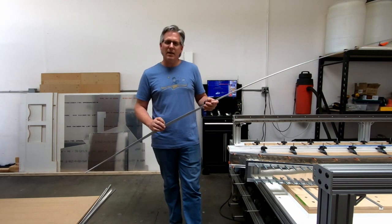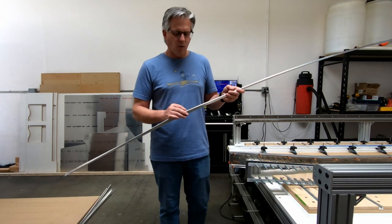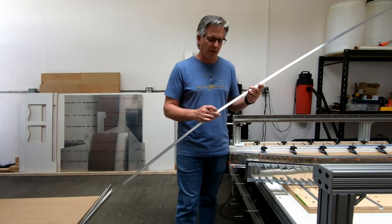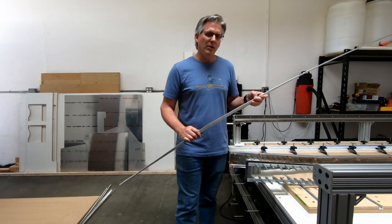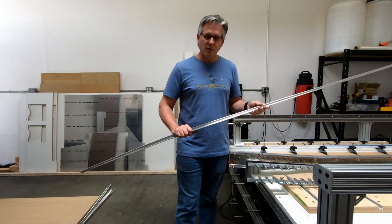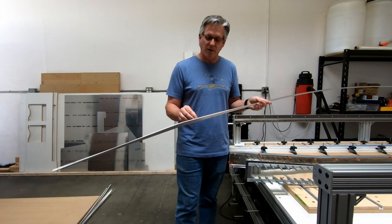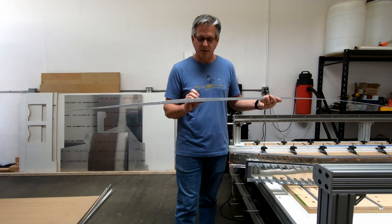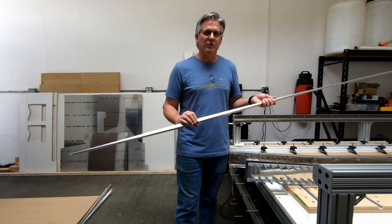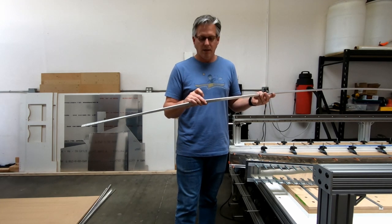So the fix is either mill that radius down — which most people don't have the equipment for — or move the rivet holes to make a little clearance. I milled my radius down to 0.125 and left the rivets in the spot specified in the plans, which is 7.5mm from the top. I still ended up with interference fit problems between the rivets and the radius. Hopefully you can see in the video — this rivet is pushed all the way down until the rivet head is hitting the radius inside, even though I've milled it down.